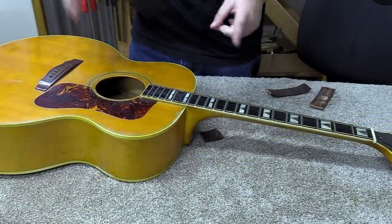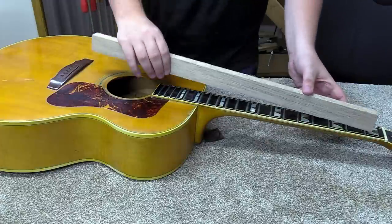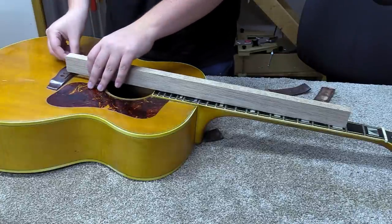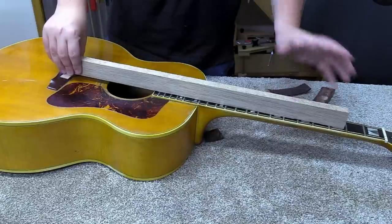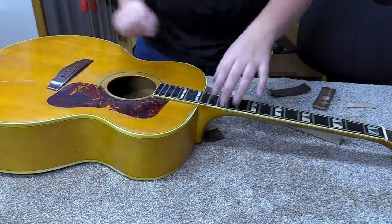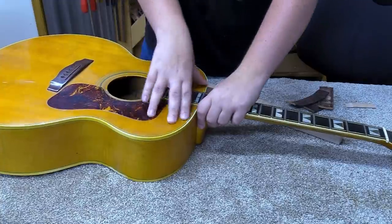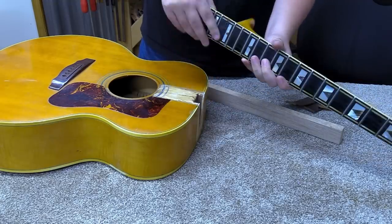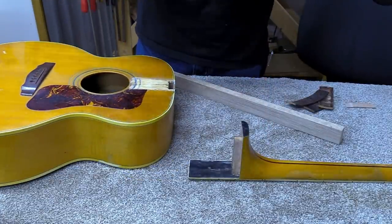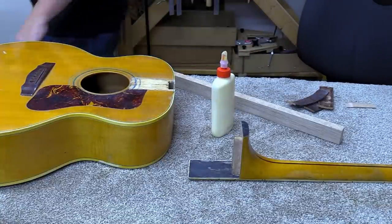We're looking good — I'm really glad we're just about ready to glue this thing up. It's seated all the way down as far as it'll go. The way I'm going to glue this up, I'm actually going to put a bar across here that sits on the bridge, because the line is perfect, and jam something in to bring that up a little more so I know the neck is stressed at the angle I want. This actually went fairly easy — this is probably one of the easier neck resets I've done in a while.